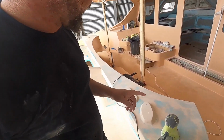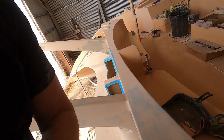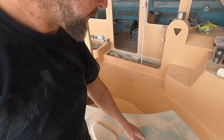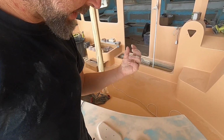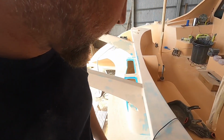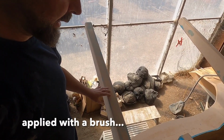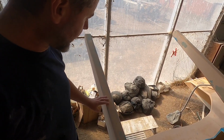It's a little bit difficult to get into the pinholes, so these are beautifully filled, but occasionally, like the air, I guess, inside the pinhole, or maybe some contaminant, some dust or something, stops the filler from getting in, or it rolls out and doesn't properly fill the pinhole. So I'll try also using a primer with a little bit of microspheres, Q cells in it.